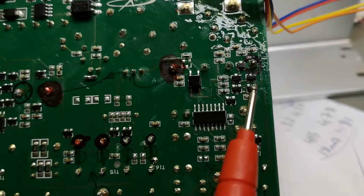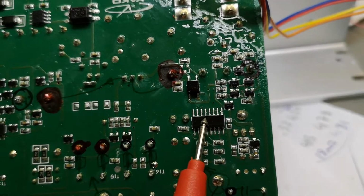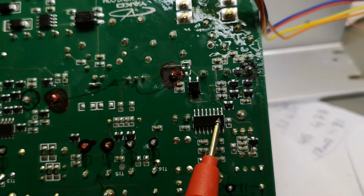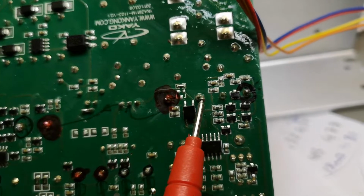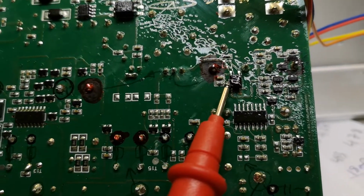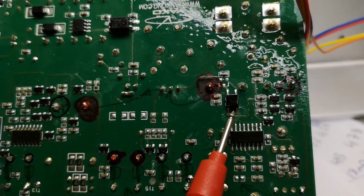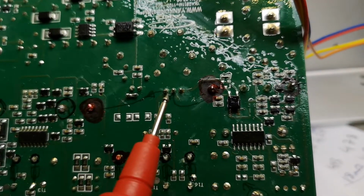See, here is the funny circuit. All those transistors here, and this is a counter system or some gates, whatever. And this is running at 4.5 kilohertz. So we have some pulses, and this is measuring the input AC, and it's triggering the Triac via an optocoupler. So I believe this is either overvoltage protection or pre-voltage regulation.